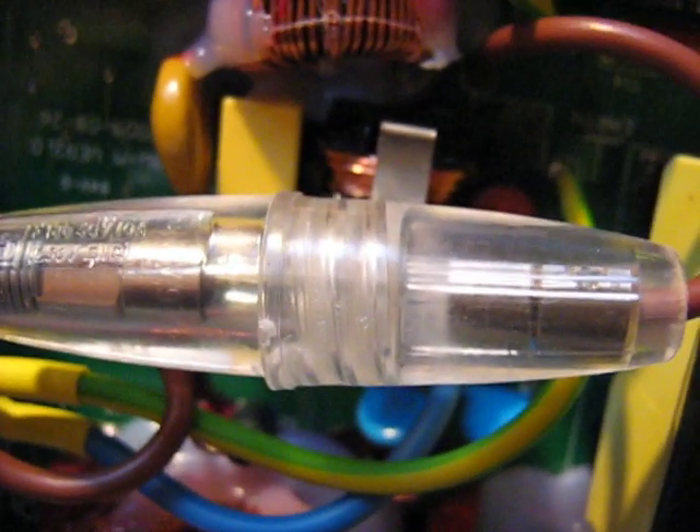Inside I've added an additional fuse. This great big fuse holder has a 1.6 amp fuse. The 5 amp fuse, which is the little brown circle there, blew. And the trouble is when it blew, it took out the choke, which is the double coil thing just to the left of it.